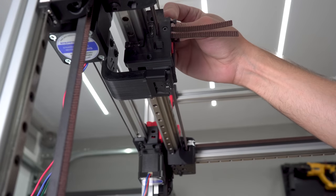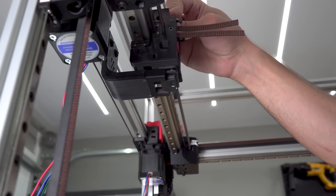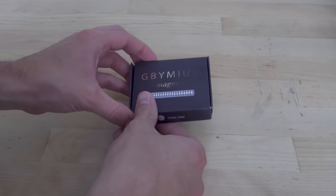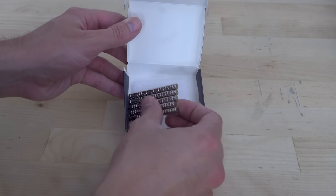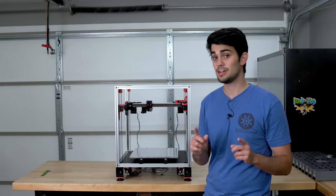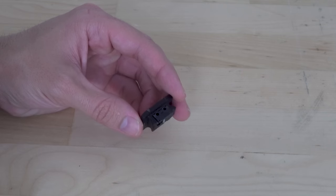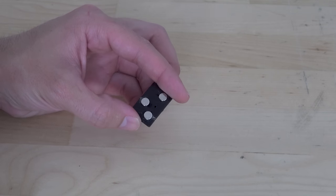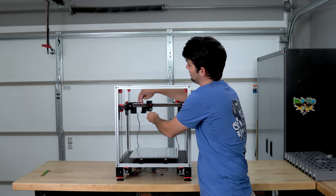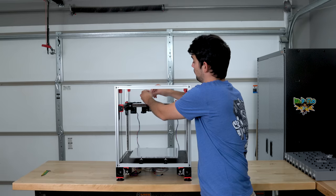Since there are no apparent electrical connections between the micro switch and the print head, how will the microcontroller know when the switch has been triggered during a probing routine? Now, what's interesting is that these electrical connections run through the neodymium magnets. Now, these magnets left uncoated would corrode, so they actually have a very thin layer of nickel around their perimeter. This nickel is conductive. So the left and right magnets are touching the normally closed and common leads of the micro switch, respectively. The magnets on the printhead are attached to these two wires. So when these magnets are attached to the magnets on the micro switch, these two wires represent the normally closed and common of the switch.